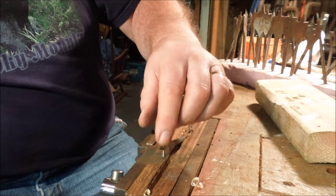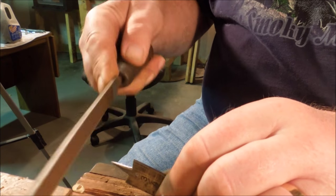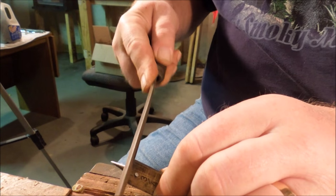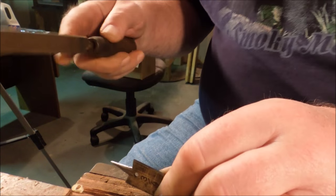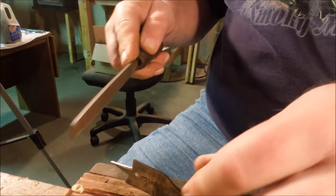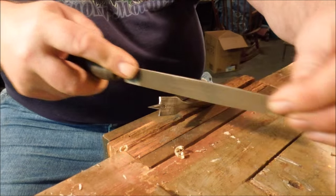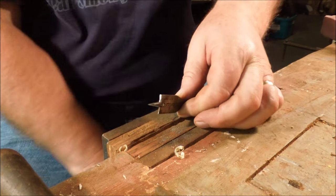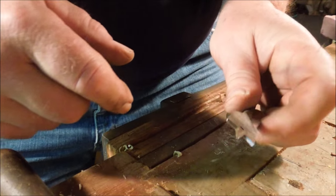Now we need to sharpen up this edge — we want about a 10 to 15 degree angle on that part of the blade too. Watch when you're filing: that edge is sharp and you don't want to run your finger up against it. If you're more comfortable, you can use two hands for better control of the file's angle. Now we've got one side sharp — we want a nice shiny edge right there. Now we're going to flip it over and do the other side.